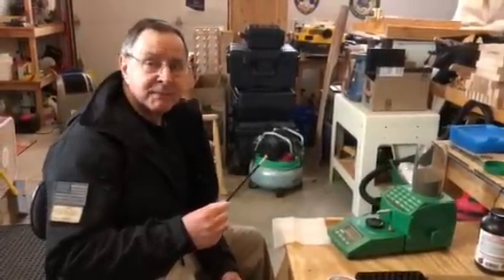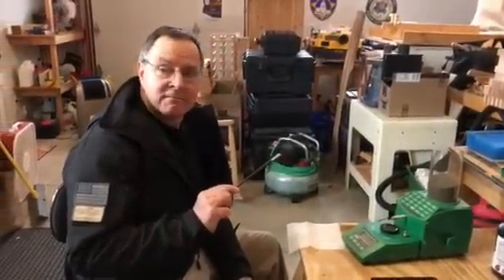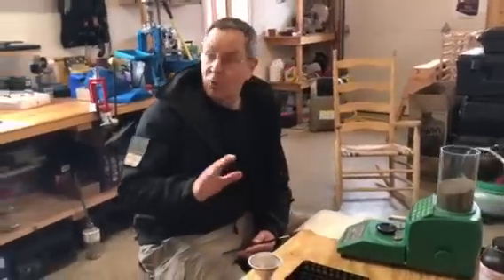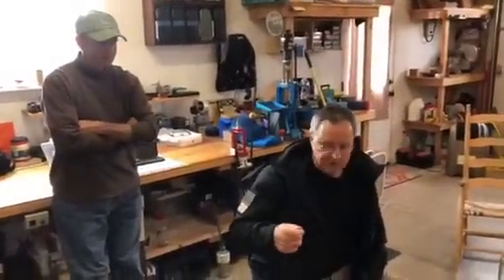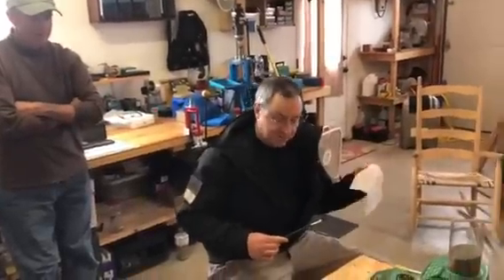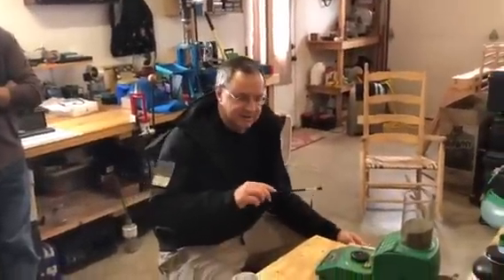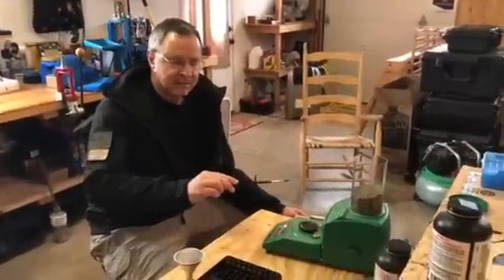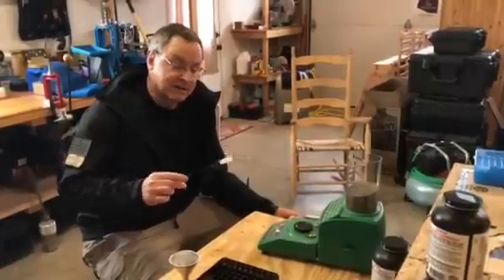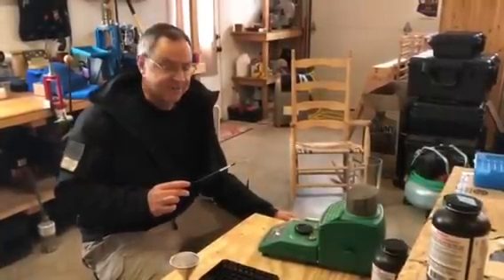A solution might be one of the aluminum pans. What made us notice this was that when we calibrated the unit it weighed 155.9, but then when I took the tray off it showed 155.6 — a difference. So I thought, let me try a Swiffer, but in the meantime I took something metal and put it across the plate, and sure enough just a little bit of metal in the brush was enough to impact the static field on the unit.